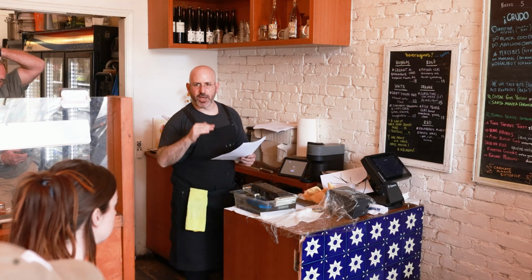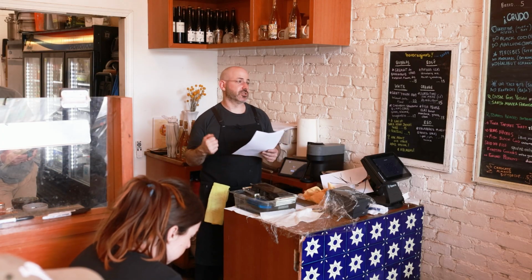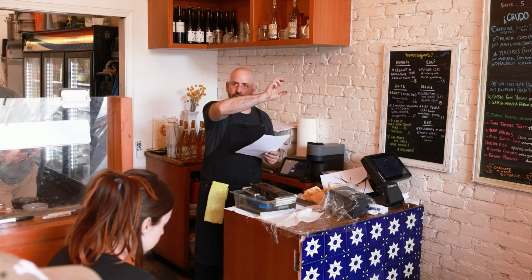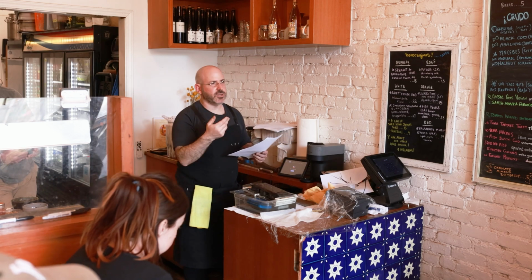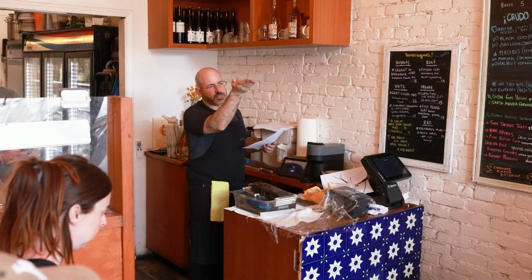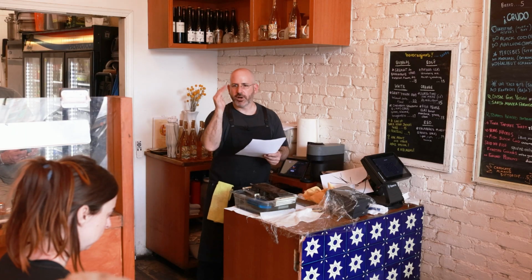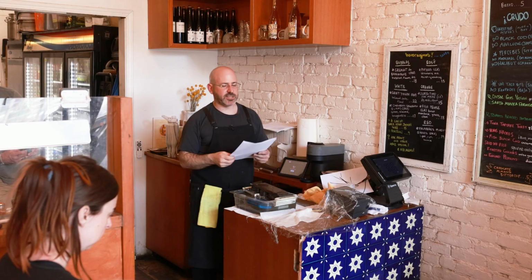You also want to find good lighting situations for what you're doing, so you can look at it and see, does it look like a smooth, flat, even plane, or do I see a lot of different ridges and facets and bevels? How consistent is that stuff looking? So natural light is the best. The long tube horizontal lights, if you can get them kind of parallel to what you're doing, can also be really helpful. But utilize lights and try and utilize a number of different angles as you look at things to give you the best perspective of what's going on. You don't want to have very rounded things. You don't want a lot of faceting as you go.